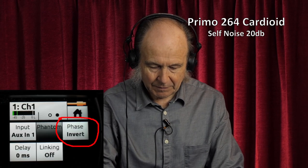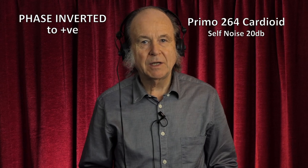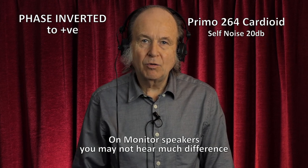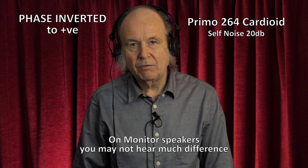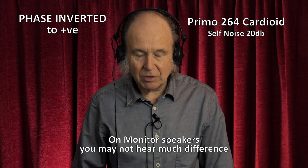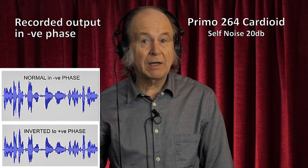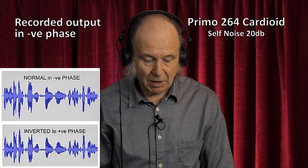Because this is a two-wire microphone, it outputs a negative phase signal which means the sound is a little bit lighter than it would be if it were a three-wire microphone. You can compensate for that by going into inverted phase. So if I now go into inverted phase on the mixer — that's inverted phase and you'll hear now that it is a very much deeper, richer sound because we've now transferred the negative phase back into a positive phase. I'll go back now to the ordinary recording — you can change it in the edit afterwards, you don't have to do it when you record.